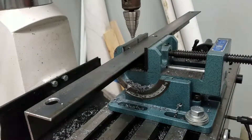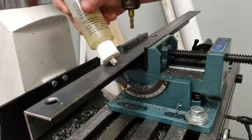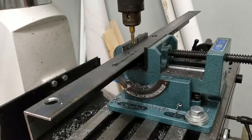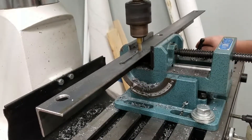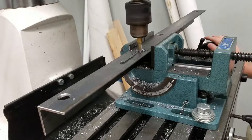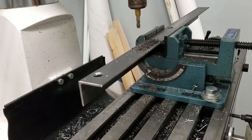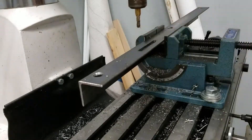The drill is in the same position. We now have our mill bit in the chuck, so we're going to get started with the milling out. Here we go. All right, now we've got our groove — this will be a nice adjustable hold-down fixture once we're done.